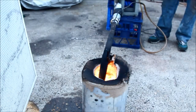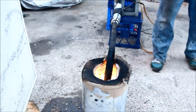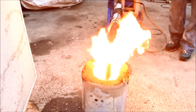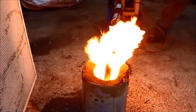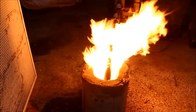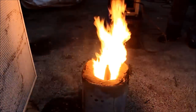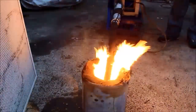The gate valve did work very well. It allows a lot of control and you can turn the flame up or down pretty much as you want. It will work on small increments but it is very repeatable and easy to adjust. You can actually put the level of the flame anywhere you want even on fixed air.